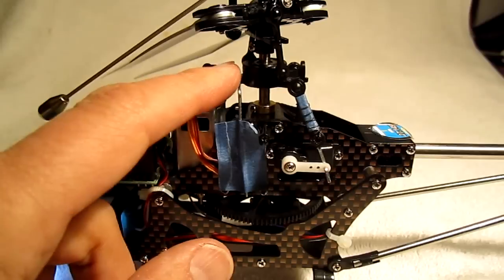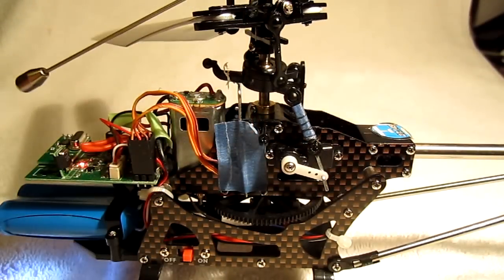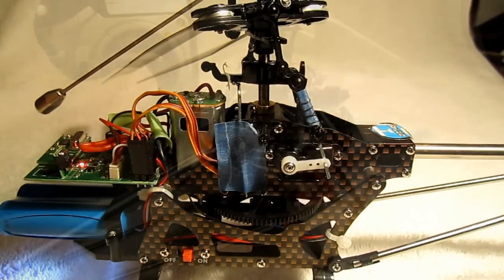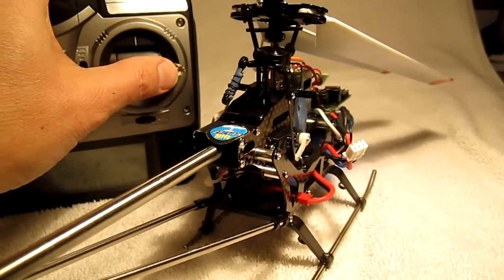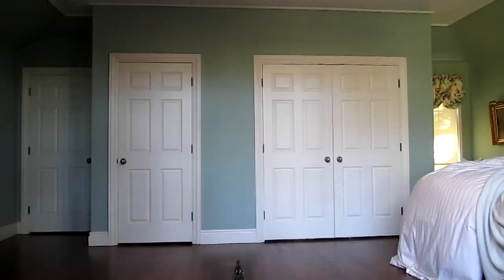Here's the side view showing the swash plate tied to the paper clip pivot, and you can see how the swash plate moves. This is normal movement for a 9116 helicopter swash plate that the 9100 now has: left, right, back, and forward.